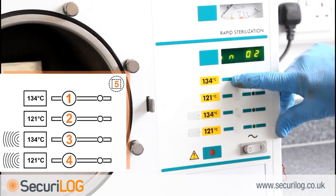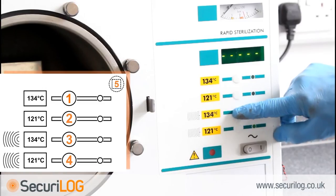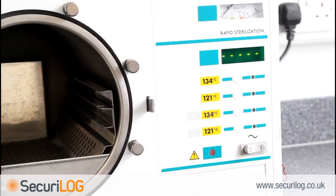The minute is a two digit number, 01 through to 59. With the display reading IN00, press button 1 to begin selecting the required number. Button 1 increases, button 2 decreases. When the number displayed corresponds with the required minute, press 3 to select. Programming is now complete. The machine will now emit several beeps to indicate a successful setup procedure.